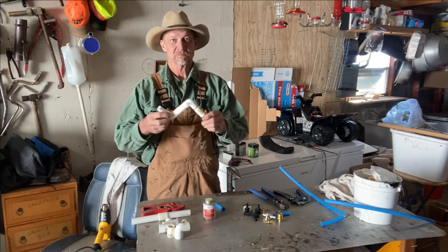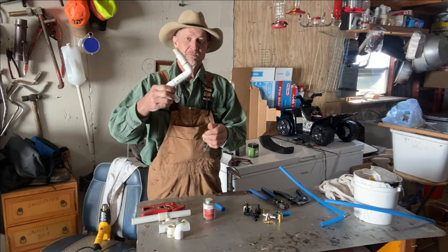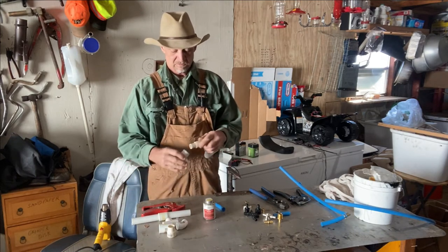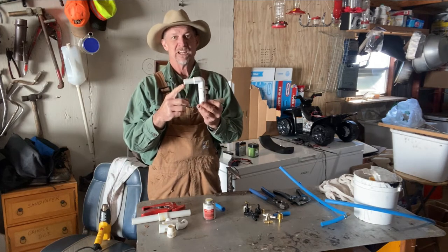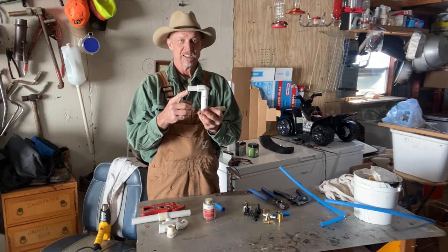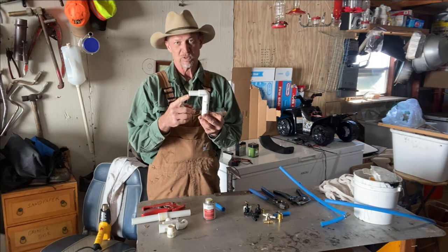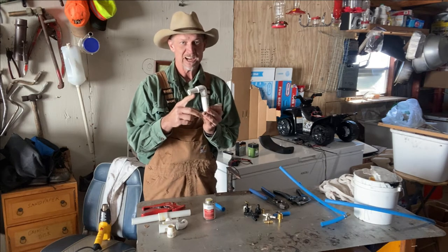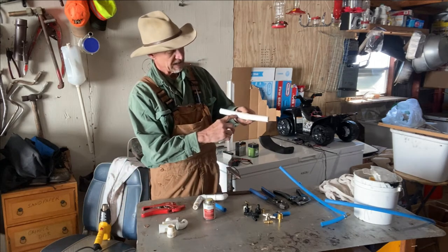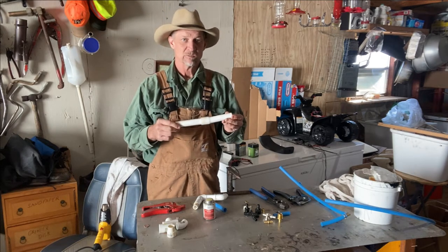To start out with, most everyone knows the old PVC. This is just a bunch of pieces that's glued together that I cut and removed from somewhere. If you've got different size pipes — half-inch hot water which is thick wall, half-inch cold water, three-quarter cold water — you have to make sure what size pipe you got and what wall thickness it is. A lot of times you can see that written on the pipe in black markings.